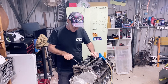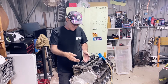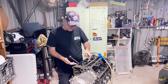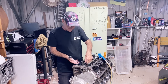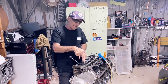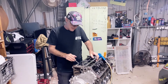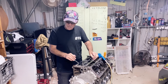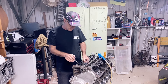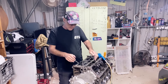The next thing Steve helped me do was set it up at another 25 thou, because we want to go down a total of 30. So four 25 thou feeler gauges under the unit so the unit was risen up. Then we dropped the tool down into the five thou rebate we'd already done, knocked out the cutters and went down to that 30 thou. We then tested with Steve's help that the piece of copper that forms the o-ring sat out about 11 thou. So it all worked out really good.